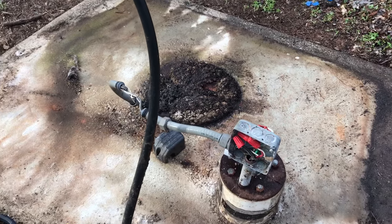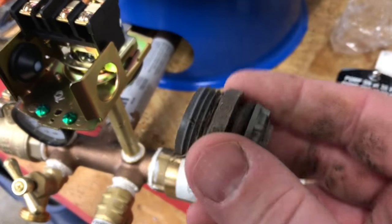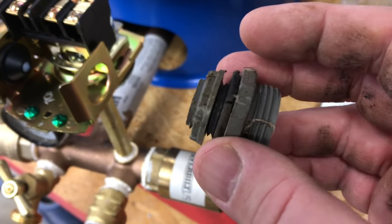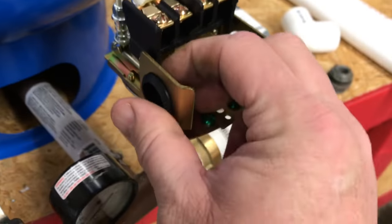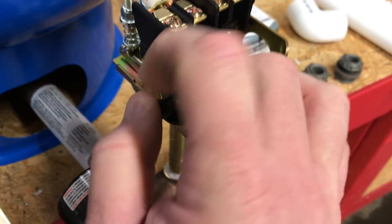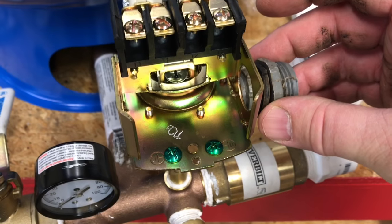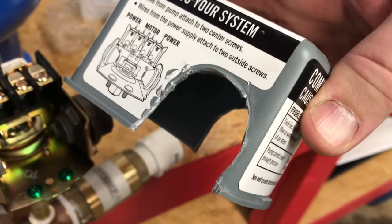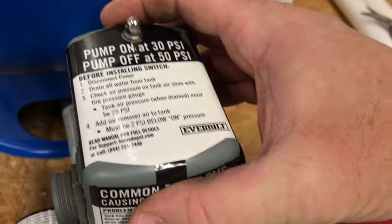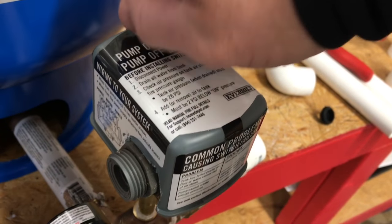Here's what it looks like with the tank removed. Let's go into the shop — I want to show you one more thing I'm going to do on our unit before we set it in. Our old regulator had these little conduit fittings here on the electrical wire going in, and I actually like that better than what the new regulator comes with, because it just comes with rubber grommets. I think I'd rather keep that conduit the same way. So you can pull these plugs out and install the conduit fittings back in like they were on the old one, and then we'll take it out there and wire it up. One thing you may have to do: after I got these things in place, my little cover wouldn't fit on quite right, so I had to take a pair of tin snips and trimmed it out just a little bit larger so my cover would fit correctly when I'm done wiring it up.